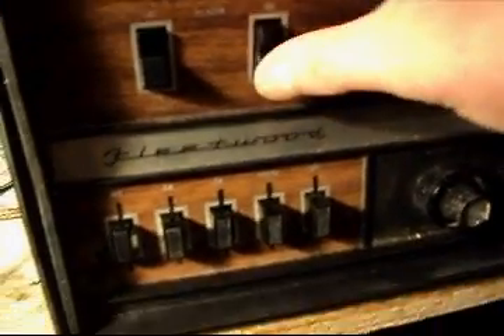The stereo light comes on. Let's see if AFC works. It's not working that great, but it's not necessary. I don't want to spend a lot of time on this because it's an older machine — it's not worth anything monetarily, but it's sentimental to the guy. I cleaned the tuner, the variable capacitor, cleaned the pots, and I'm getting some life. I'm going to have to figure out why this unit is quiet on one side.